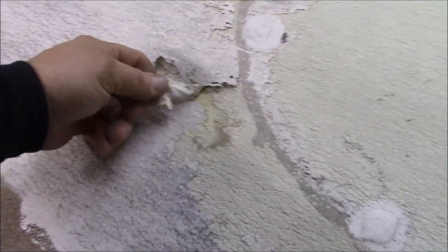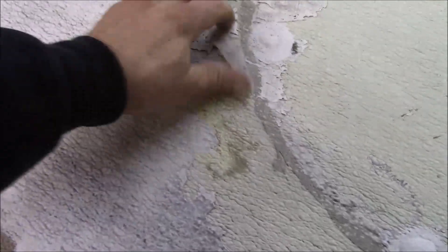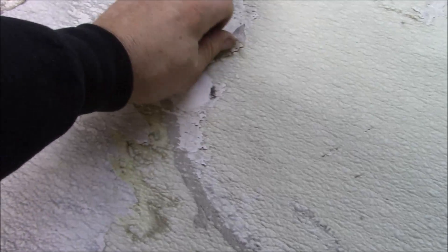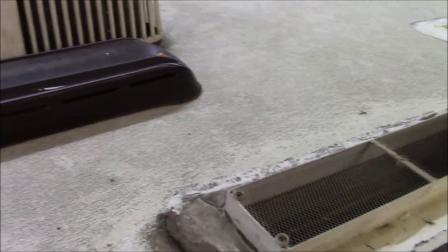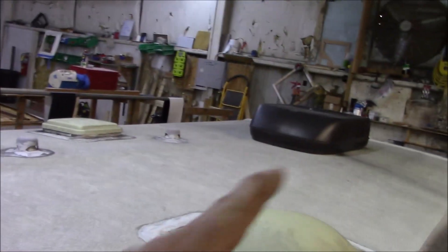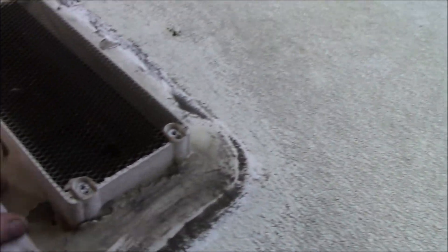There's a coating here — this is why we don't do coatings. It's all peeling up. What good is it? These surfaces need to be prepped really well, and a lot of times they need to be primed. It's not a cure-all. There are different types: silicone ones and acrylic ones. The acrylic ones only reflect UV light — that's it. Silicone is probably a little better, but when water gets underneath a peeling coating it travels and causes leaks. We're really not fans of coating systems for RVs.